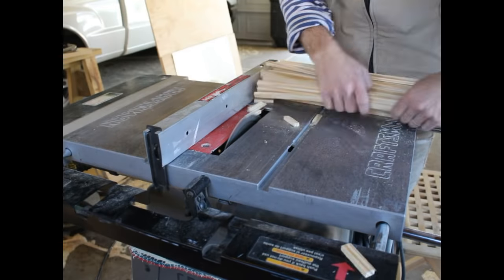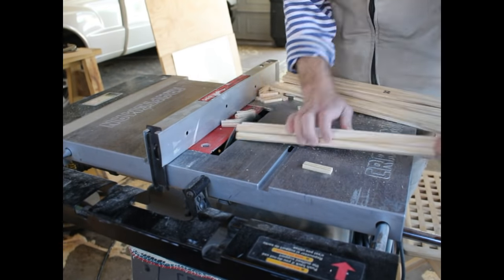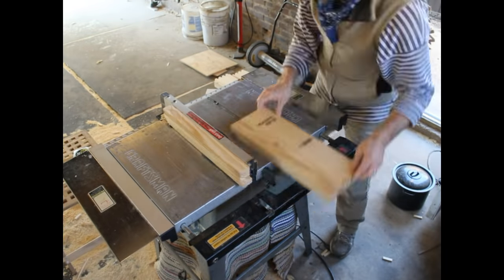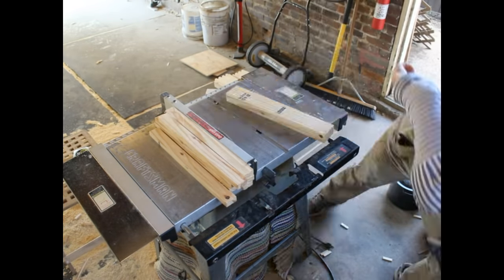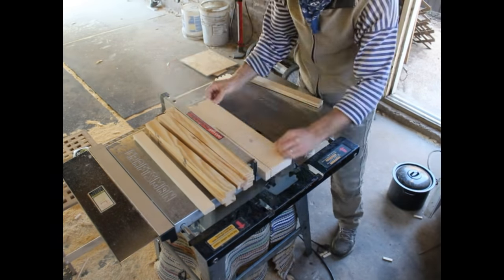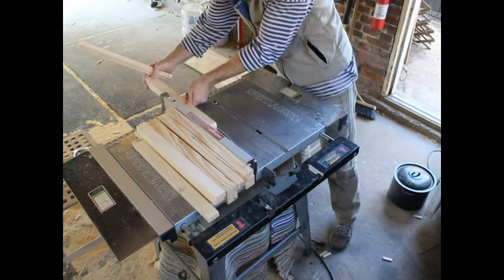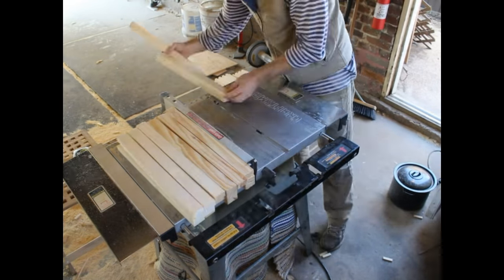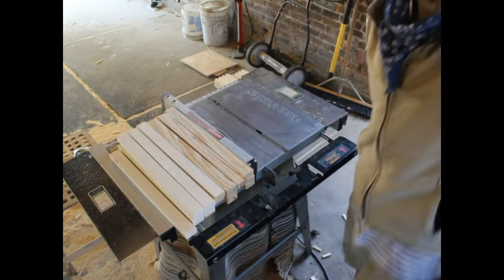Here are those little boards that tack on to hold the wax in place — cutting them to length, 17 inches. And now I'm cutting the bottom pieces to the right width. Then I have to make a little jig. Each one of these larger chunks I cut into three different bottoms, which are 3 quarters of an inch by 3 eighths of an inch.